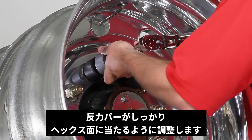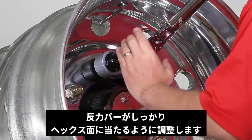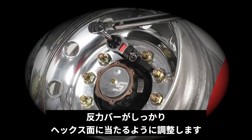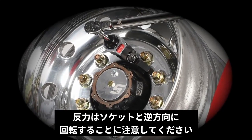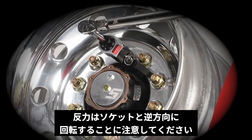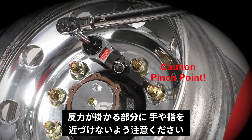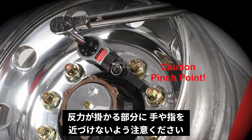When the multiplier is assembled and you have your torque wrench ready, the assembly needs to be positioned so that the reaction fixture is against an appropriate blocking surface. Always keep in mind that the reaction fixture turns in the opposite direction as the socket. The reaction fixture creates a pinch point — always keep hands and fingers away from this area.